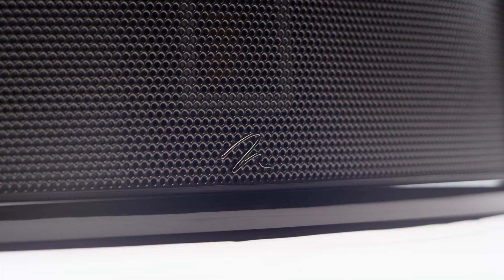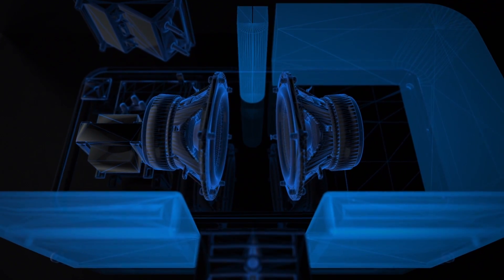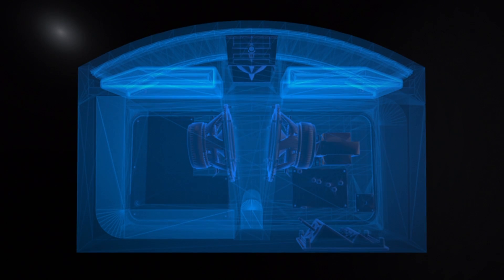The technologies that we've used in the ESL-C are our standard curvilinear electrostatic panel and our folded motion tweeter. The advantage of a folded motion tweeter is that it has lots of diaphragm area. That extra area allows the diaphragm to move very little for the amount of sound that it generates, providing a really clean sound with some vertical control of the dispersion. We also have a unique woofer design — we had to turn the woofers to face each other and fire out through a slot where the bass comes out through and around the tweeter and through the middle of the two ESL panels, creating a coherent sound from the woofer to the panel to the tweeter that all blends together very nicely.